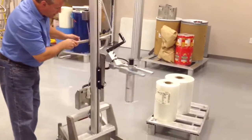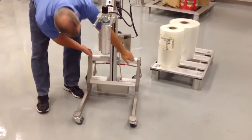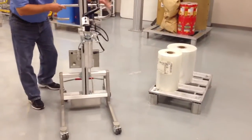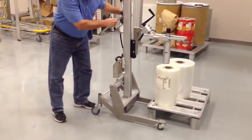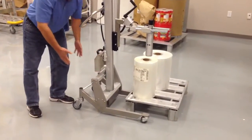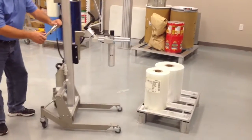If you spin it around out front here, you basically have a set of low-built legs, and then we have the intermediate section, which is the section between the legs. And if you look very closely here, you'll see how the low-built legs fit very nicely underneath the aluminum pallet stand. And in doing this, we can keep a lifter to a standard width instead of making the lifter very, very wide.